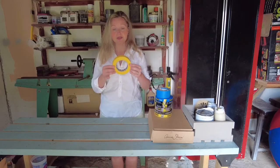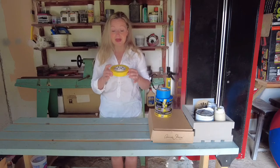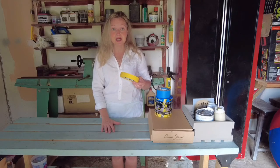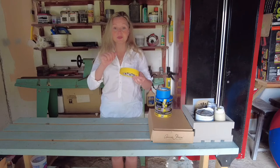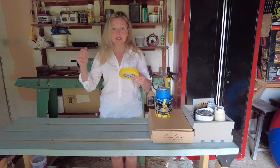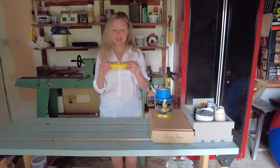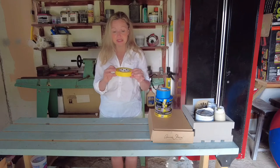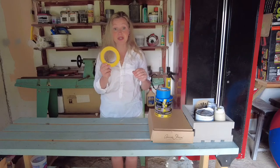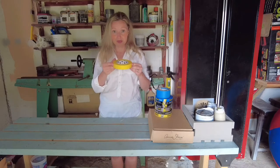This yellow tape is just a regular old masking tape. If you leave this on for longer than a day it will start to tear when you take it off. However, this is a great inexpensive tape if you want to glue some paper down to the floor, tape plastic sheeting to the wall, or stick together sheeting when wrapping up furniture. It's not very expensive — really budget friendly — but if you use it on windows or floors, remember to take it off pretty quickly, otherwise it's going to tear and you'll be scraping with your fingernails.